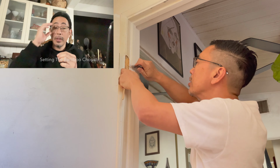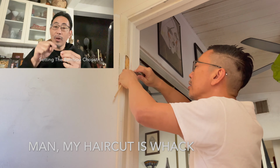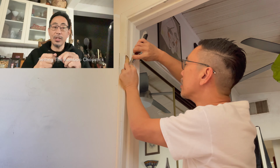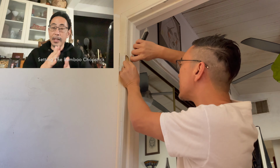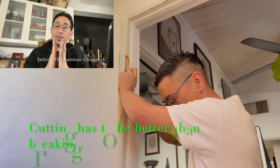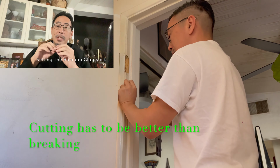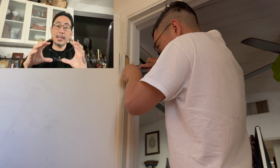After I get the wood in there and break off the chopstick, I noticed that when I was breaking it off, it was breaking off more of the chopstick on the inside and less on the outside. So I decided to take a chisel or a knife, you can use anything, and then use a hammer to put the edge up against it and slice it off. By slicing it off, there's more material left on the inside that's going to give your screw more material to expand into to create a nice tight hold